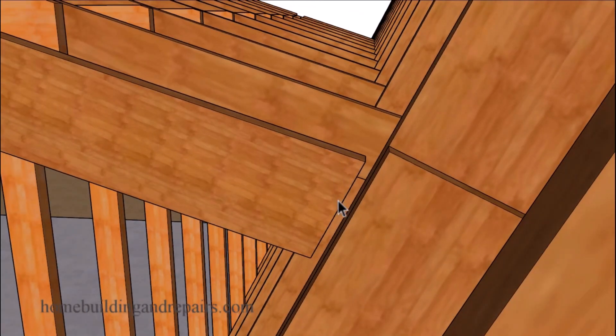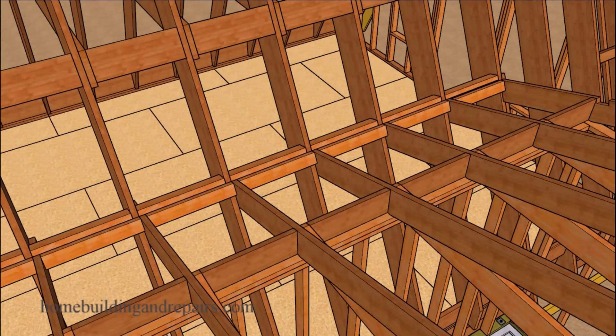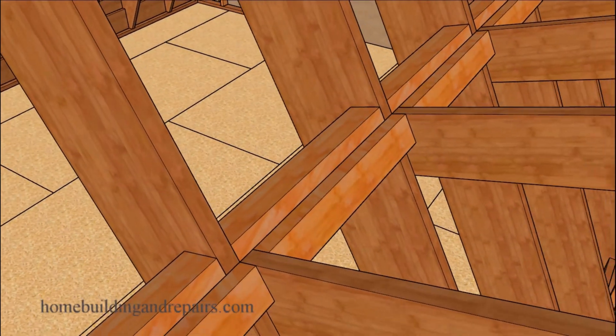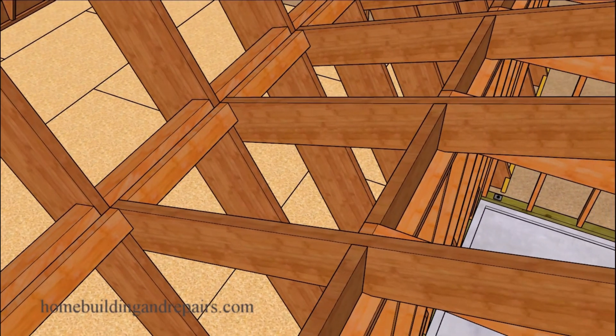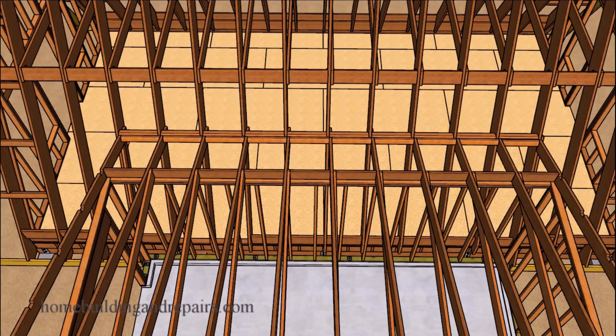I chose to install this rafter on top of the sheathing instead of setting it on top of the rafter, which works better for the roof sheathing than if I had notched around it. We're going to install some blocks here — two-by-four or two-by-six, whatever you feel you need — and the upper section of the blocks will be shaped a little bit, though they could also be installed differently if you don't want to shape them. The rafter blocks in the garage will be shaped to provide a nice, tight structural connection between the sheathing, rafters, and blocks.